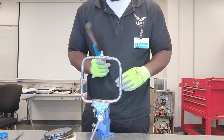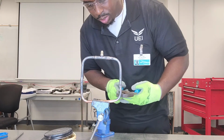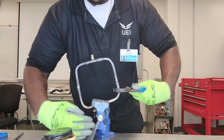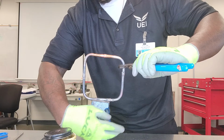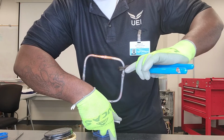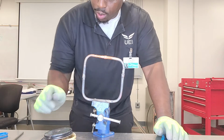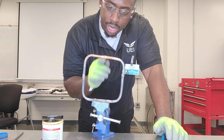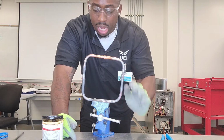I'm gonna go ahead and turn this over so I can do that bottom joint, and I'm gonna do that one with the Stay Bright 8 and my MAP gas torch. So got my channel locks here. Go ahead and flip that over. Okay, so when I was prepping it, I put my flux on this joint, on the male end. I put it on the male end, put it inside the female, and now it's ready to go.